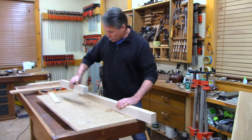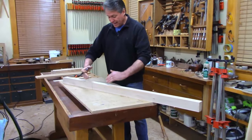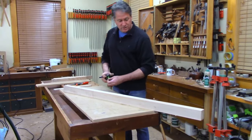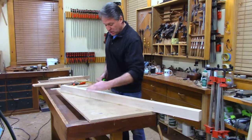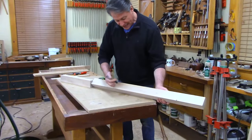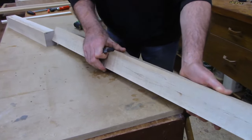this was some 12-quarter material. So this was together like this, and this was a plank that was pretty wide, and I used the other pieces, I forget, I think maybe for a pencil post bed or something like that. So this was a pretty wide plank. So all of that was gone. But it's plain sawn in this direction. So you can see the wider bands here. And on the edge, you see all that linear grain. And you see how that curl really pops.